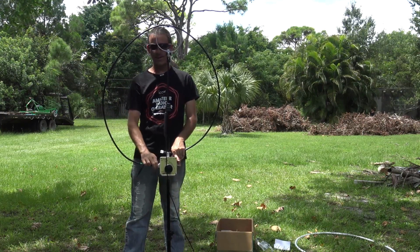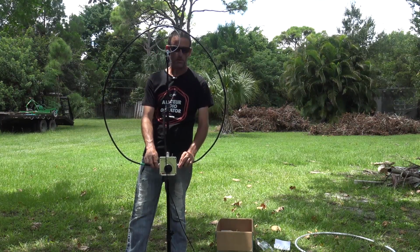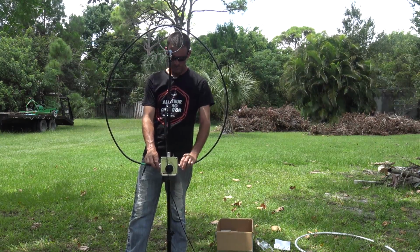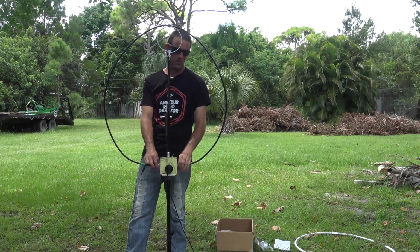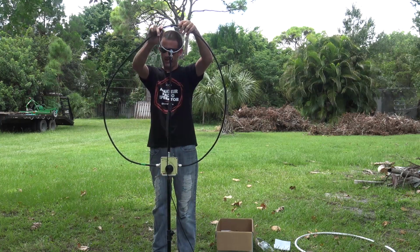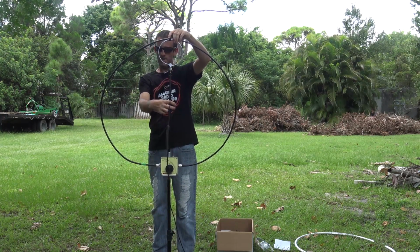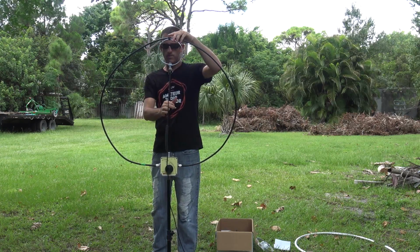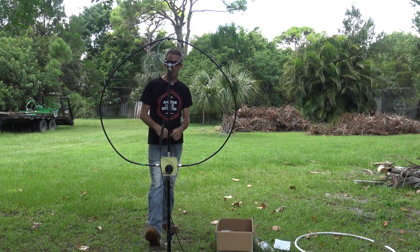So this is a very high Q antenna, meaning all your efficiency is going to be focused at one spot. But if you want to move up from CW to the sideband portion, or CW to phone portion, you're going to have to bump the tuning. It's very, very narrow banded, except if you go with the metal radiator, but it's just the result of having an antenna like this. And again, the theory will explain more on why that happens.